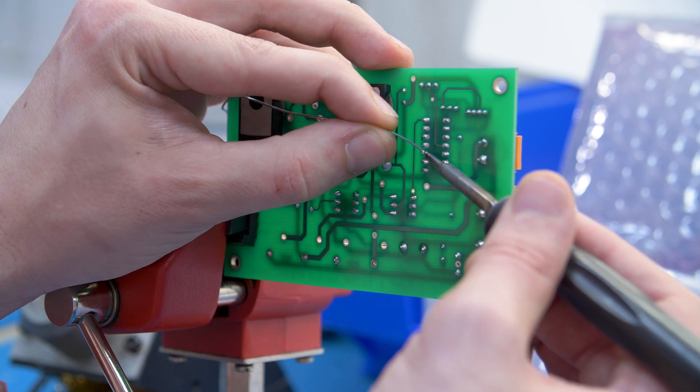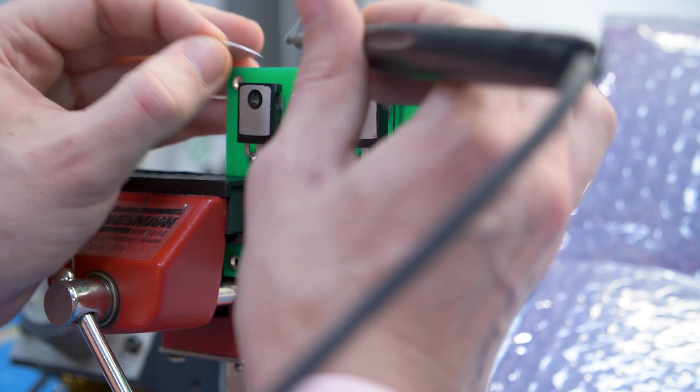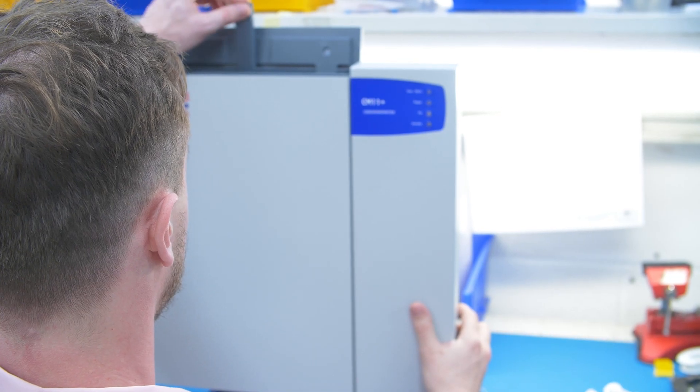We actually use a special solid gold measurement cell, and that is an advantage because it has such a low resistance and it's resistant to galvanisation in the solutions. We also use a closed circuit loop which is different from other competitors, and that's an advantage because you get more reliable readings at the end because you haven't re-gened as you're going.